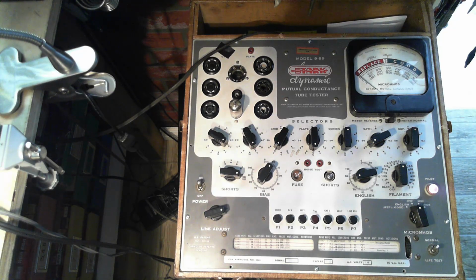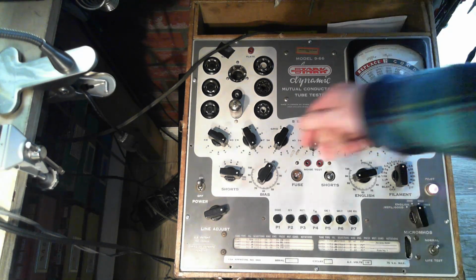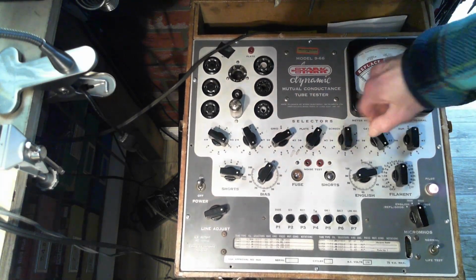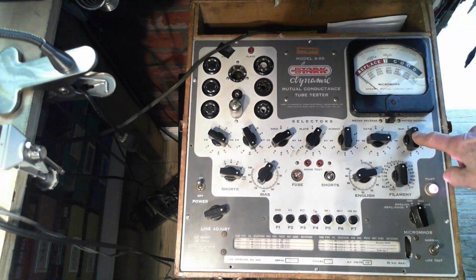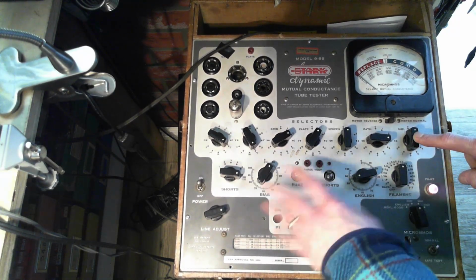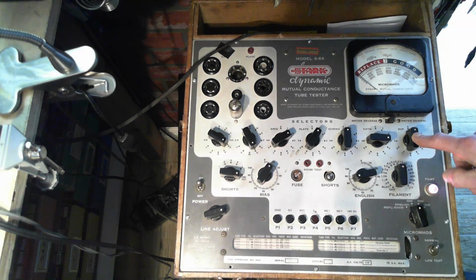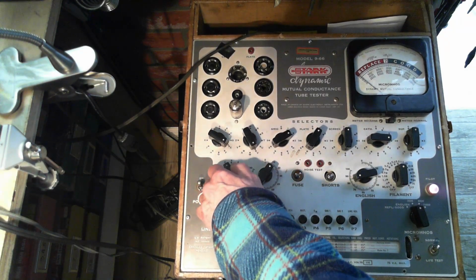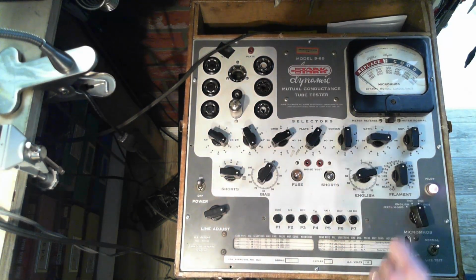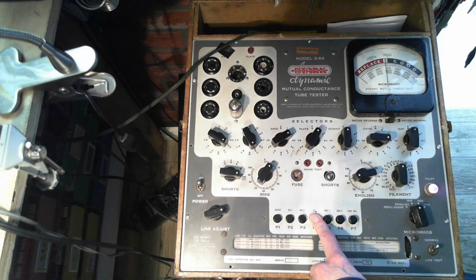ECC85, EV 2103. 2103. And the last number, 0. 1185, same as the other two, 1185. Okay, short test. That seems better, flashes. Not a better tube though, better half. It's going down, it's falling down a little bit.